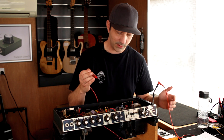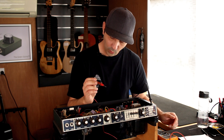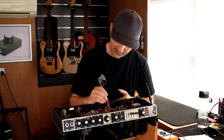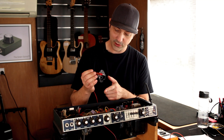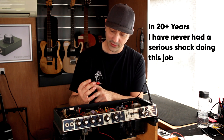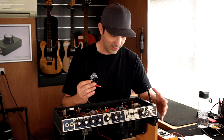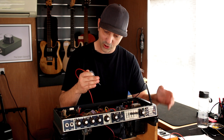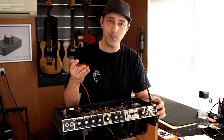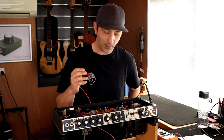When testing inside an amplifier with my multimeter doing voltage tests, I always ground my hand or somewhere close by to the chassis. I do that because if I do get a shock, it goes through my hand straight back into the chassis — the shortest path possible. If I'm holding the chassis with one hand and get a shock in the other hand, the electricity is going to travel right through my heart, and that pretty much means you're going to die.